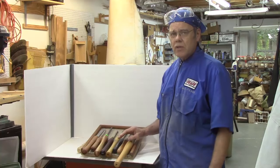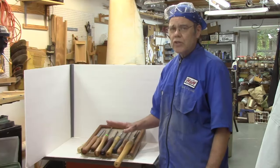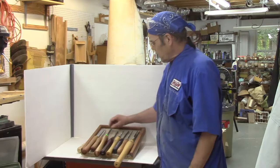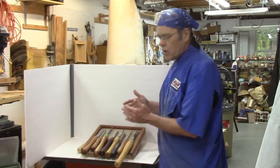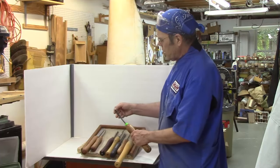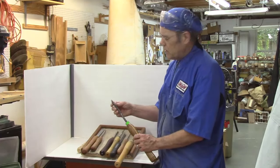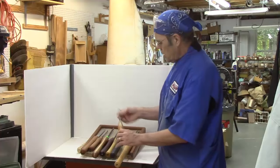There are lots of different tools I use for beading. I'll briefly introduce you to them now and then show you in detail how to use them. First, the most obvious is a 3/8 inch spindle gouge — a shallow fluted gouge. For finer detail, I use an actual detail gouge with very shallow flutes, more steel, and a pointier tip. That's a 3/8, and I've also got a smaller quarter inch version for very small projects.